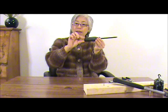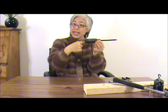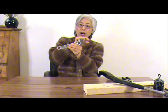A screwdriver also helps to save force. The applied force has a large lever arm — the radius of the handle — while the resistance force has a smaller lever arm, the radius of the tip end. And if I use a wrench, I can apply a large force easily because of the convenient handle, and I can overcome a much larger resistance force because the lever arm for the applied force is much larger than the lever arm for the resistance force.